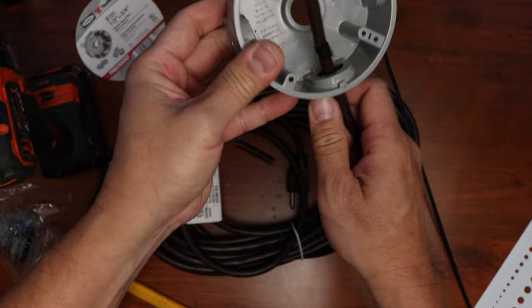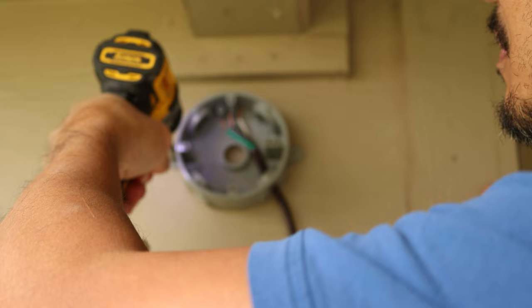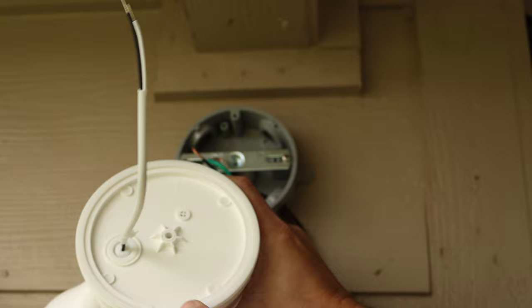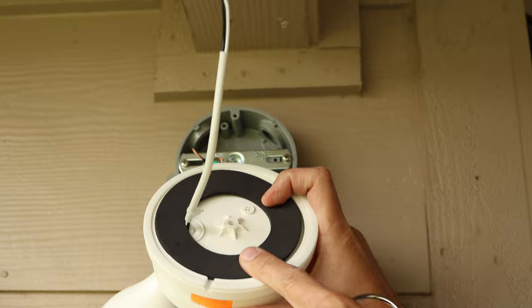Strip the individual wires, then install this setup outside. Screw the round box into a wall or ceiling using two screws. You'll now be able to install any floodlight camera you like — in this case, the Wyze Cam floodlight. Screw the ground wire to the metal bracket and screw the metal bracket to the junction box. Because the Wyze Cam floodlight's base is a bit bigger than the round box and its weather gasket can't sit flush, you'll need a round gasket — I'll link it below — placed on the back of the floodlight to provide weather sealing.